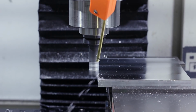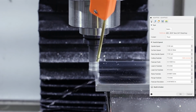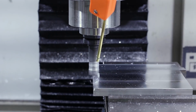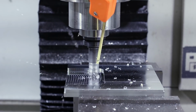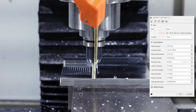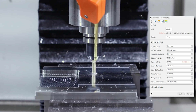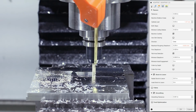Next up, we're going to take care of roughing with the shear hog, running it at 5140 RPM, 75 inches a minute, 0.15 depth of cut and width of cut. One more adaptive with tool 31, our 1/4 inch flat end mill, running that at 5140 RPM, 2 thou feed per tooth, a 1/4 inch depth of cut, and 50 thou width of cut.